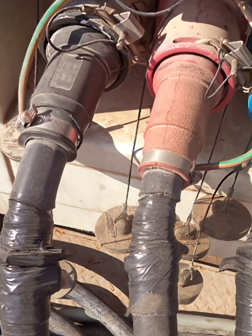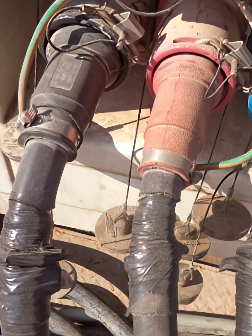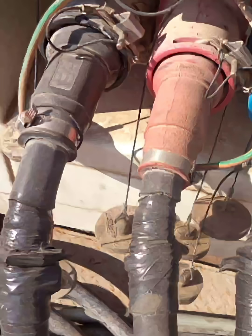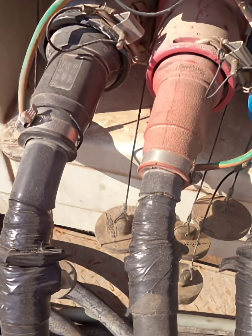Safety issues identified. 1. Improper cable repair: the heavy wrapping with black tape indicates damaged insulation, poor quality field repair, and possible exposure of conductors underneath. Electrical tape is not a substitute for proper re-termination or gland replacement.